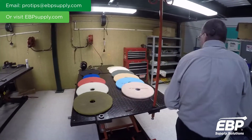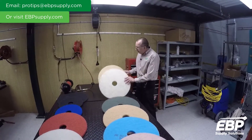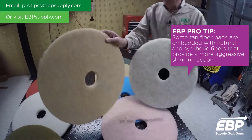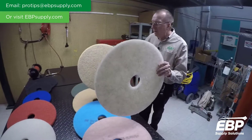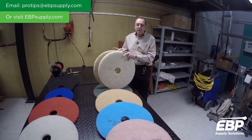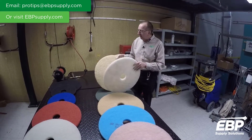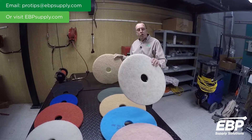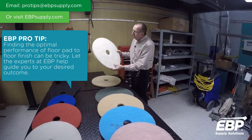On the other side, I want to continue on with burnishers. The burnishers use all of these pads. Starting at this end, we've got a couple of pads with hair in them. This one is hard, and this one is a little softer. Typically with a burnisher, we want to be shining floors, and there are many different types of finish. All these different pads have an application based on how hard or soft the finish is. A really hard pad on a really hard finish is not going to be as effective as a softer pad, because the soft pad will stick to it a little better to get that shine.